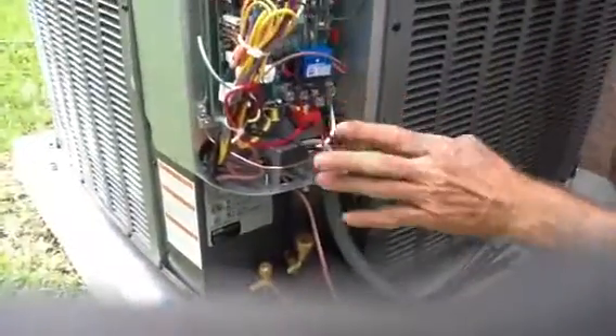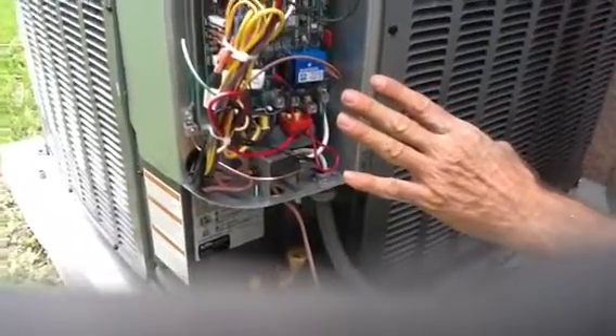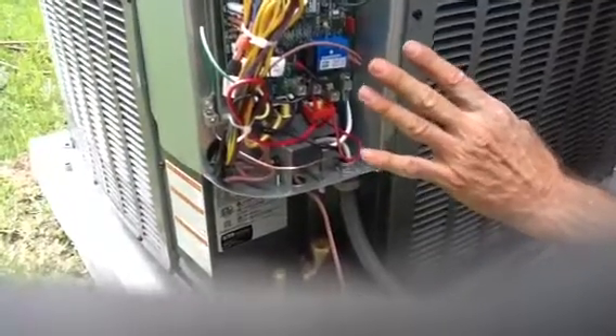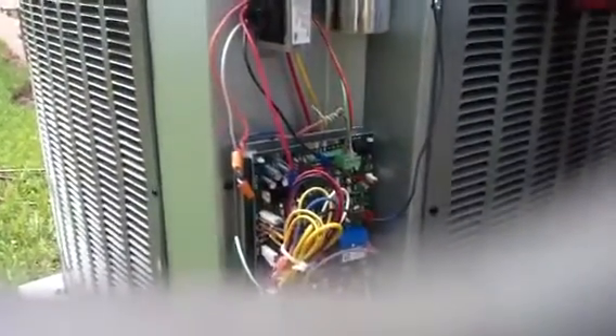He's brought his 240 volts in and hooked it up to the bottom of this board. That's how you do it: if you ever get into a situation where you need to manufacture your own separate 24 volts for a communicating system, just add a separate transformer and come off the power you have available. If you ever have questions, call Jones Air Conditioning and Electrical at 239-596-5855.